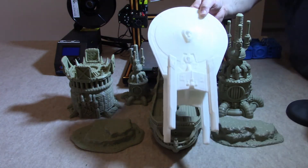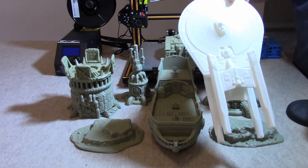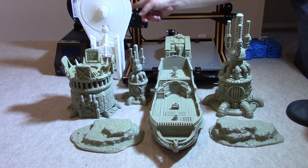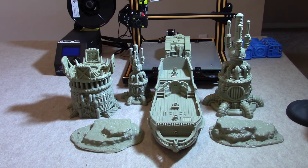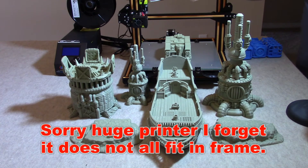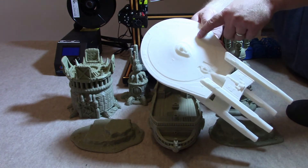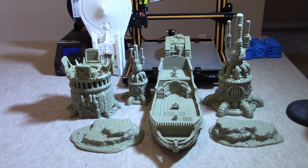You'll see a couple lines on it, and I think this is where my one little nitpick is: the X-axis cable is short. When you hit about that 12-inch mark on the Z position, as it's moving up, the cable that connects to your X-axis and extruder starts getting tight. So I had my control box farther away from the machine — if you're going to be printing between 12 and 16 inches, you want to make sure that box is pretty close to the printer because that cable gets a little taut and it added a couple of lines. But I shoved it in, it finished the print with no problem, and the support stayed together all the way up.